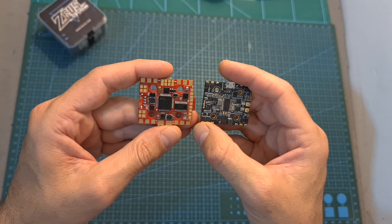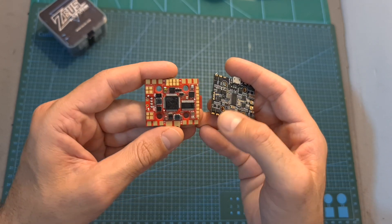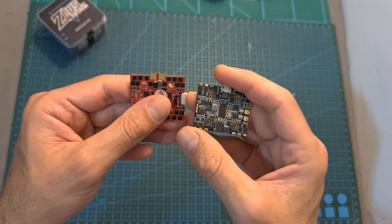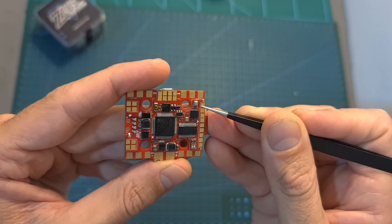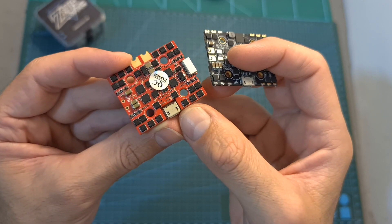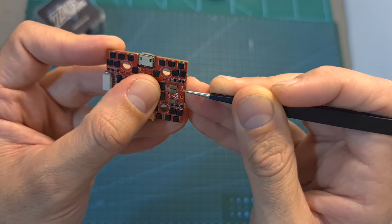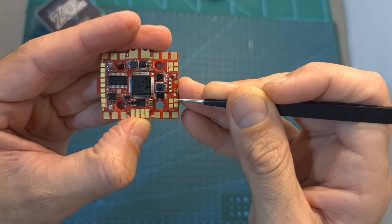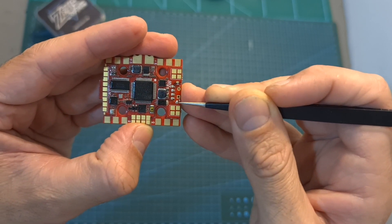In comparison to the Zeus 35, the Pro features an upgraded processor, bigger pads which are much easier to work with, a dedicated JST connector for the DJI air unit, two extra full UART ports, an onboard barometer, and a 9V 1A BEC. Its micro USB port — which is unfortunately still not USB Type-C — is better protected, and it features two dedicated holes for a capacitor. UART 3 can also be converted to I2C in order to use the flight controller with a GPS with a built-in compass.